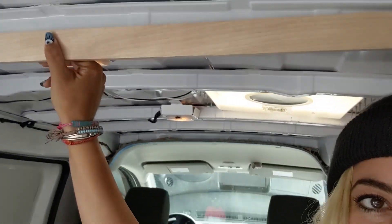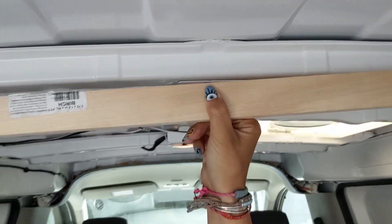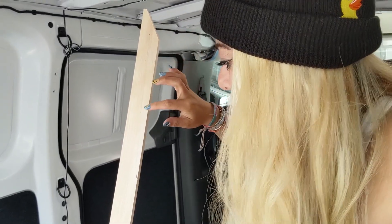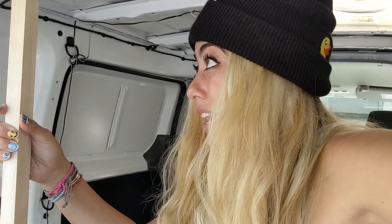The problem is that my ceiling is curved — it's hitting the top on the ends but the middle is not making contact. I tried measuring out the curve the other day, but I realized I couldn't cut it because this piece is too narrow for my jigsaw to fit on. I used a regular hand saw to take off the corner, but I talked to a friend and got the idea to put other pieces of wood next to it so I can run my jigsaw over — I'm going to try that right now, and hopefully it works.